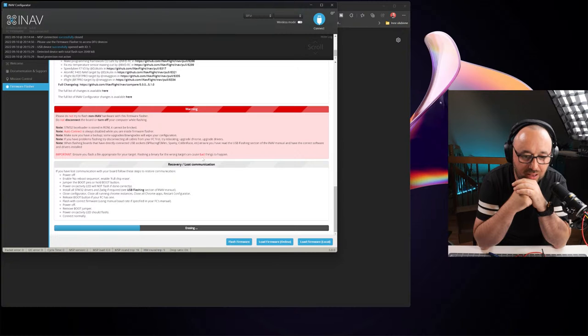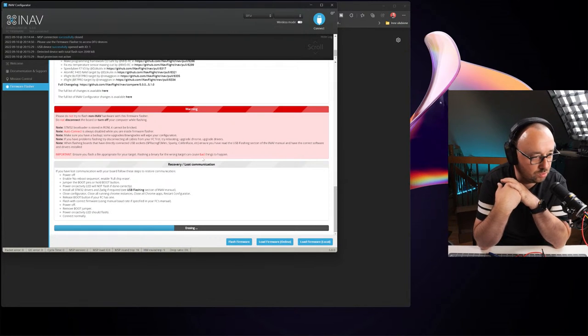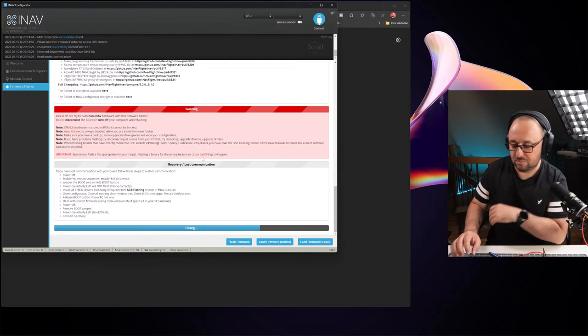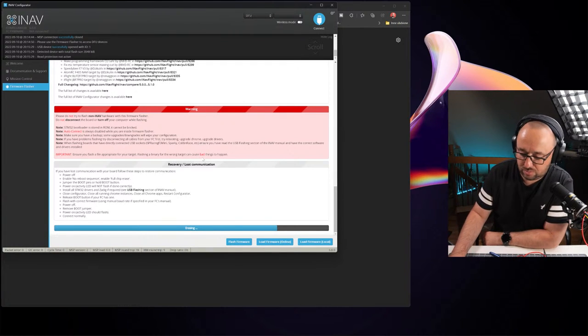Peter, yes, I applied it 10 minutes ago and I'm powering up now. Exactly, but this is a conformal coating. Nothing wrong will happen if I just power it up right now, because this is not conductive. This is very important. This is not conductive. So even if this is not yet ready, nothing really bad will happen. So we are absolutely fine on this thing.